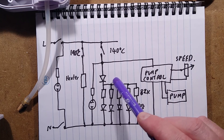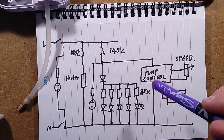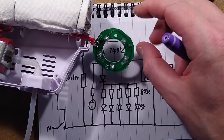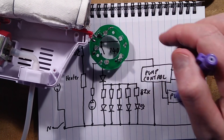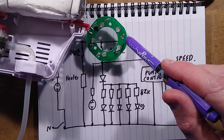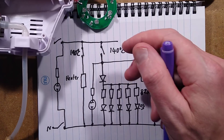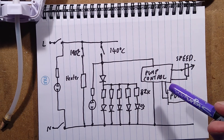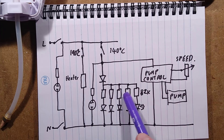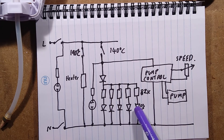The pump control module has basically six wires going into it: Live and Neutral going in, two connections coming out to the pump, and two connections going out to the potentiometer. What's really odd is that the circuit board in the front has one diode for rectification — so quite flickery — and then it's got a circle of LEDs. But it's got five resistors in series with five LEDs. They could have put all those LEDs in series and it would have been so much more efficient.